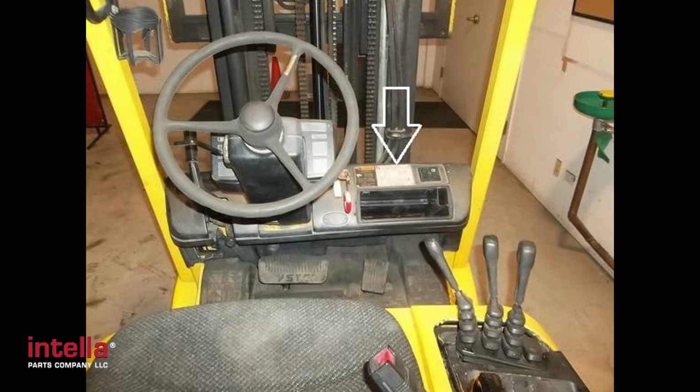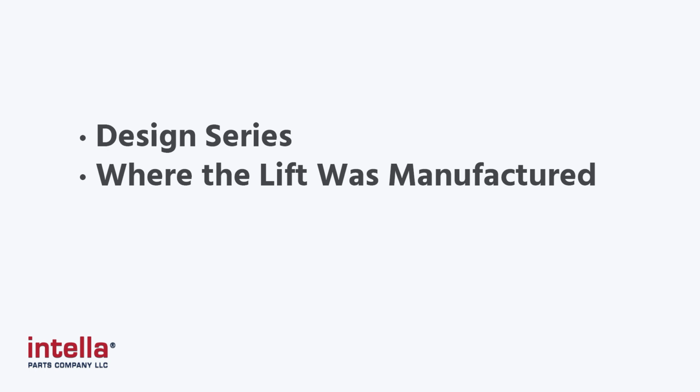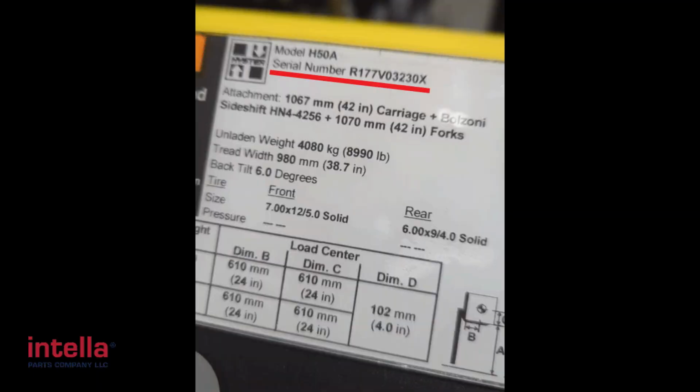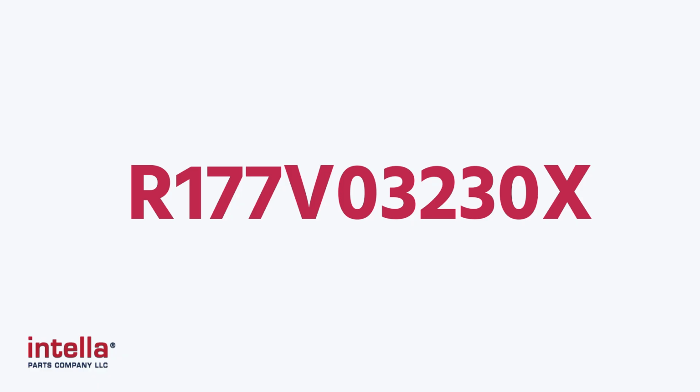Starting in 1957, Hyster forklift serial numbers come in 4 parts and give information about 4 different things: the design series of the forklift, where the lift was manufactured, the production sequence number, and the year that it was made. On our Hyster, we have a serial number R177V03230X. So what does all that mean?